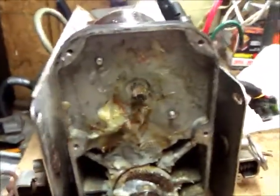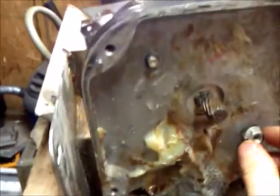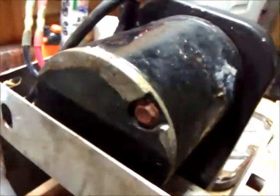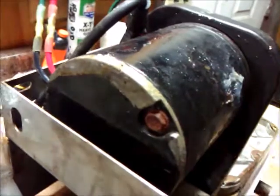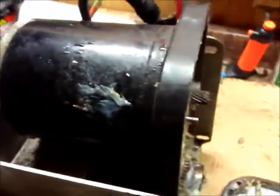You can see the wiring — I've already disconnected and cut it; those will need to be repaired if we get this all working again. Next thing I did was take off these small nuts that hold the electric motor into the case — there are two of them. That's typical of an electric motor. Those usually run all the way through the motor and not only hold the motor on, but keep the motor together — they keep the windings from coming apart. So we're going to take those out once we get the motor free.